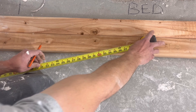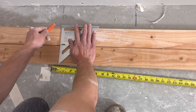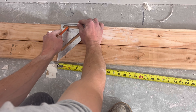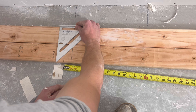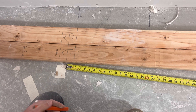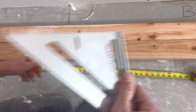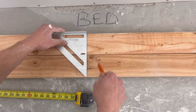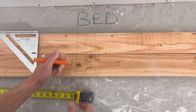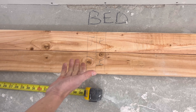So that's our opening, and then you take your square, get your mark, go an inch and a half over, and do it again. This would be your king stud, this would be your trimmer, same thing over here. This would be the start of the opening of your door, and then the same thing over here — inch and a half, inch and a half — trimmer and king. That's how a door is laid out.